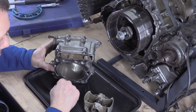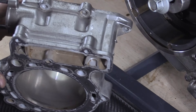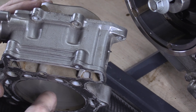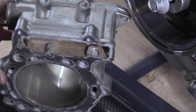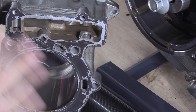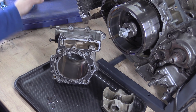As far as this cylinder is concerned, one of the main things I'd be worried about straight away without even measuring anything is this lip here. Is there a lip? So you get your nail and push in, then drag back out. I can't feel anything there — absolutely nothing at all.